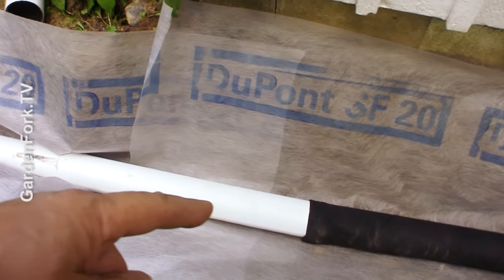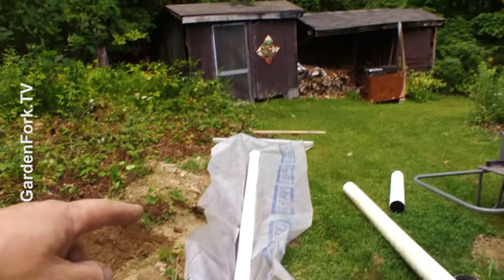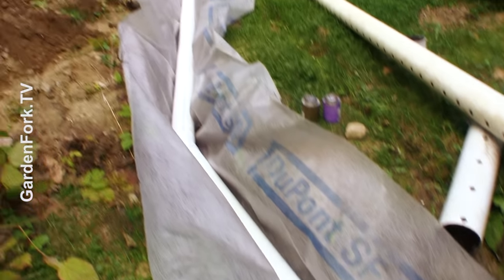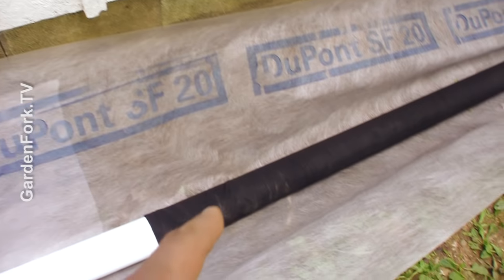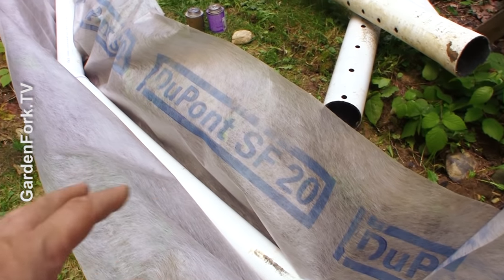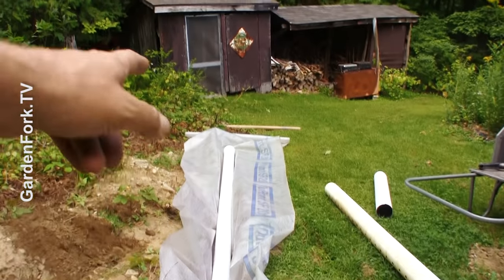Right here it changes to a solid pipe, and I've extended the sediment or filter fabric material all the way to the end. I overlap this so that the first piece lays on top of the second piece, and then we're gonna lay gravel on top of this pipe. The idea is if some water doesn't get into the pipe itself, it'll travel along through the gravel and won't be impeded by gravel that's got silt in it, and it will go to what's called daylight — the end of the pipe.